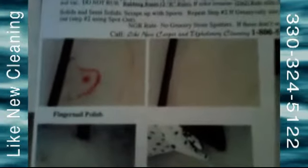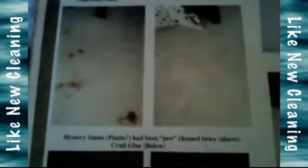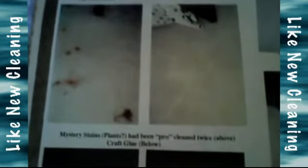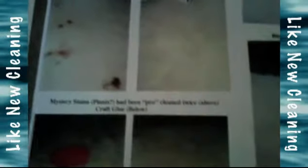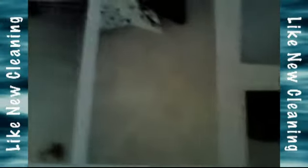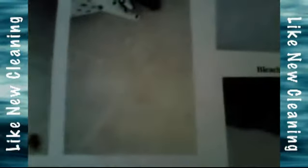We're going to do some videos on these as well. We also do an extensive amount of specialty spot removal. That's fingernail polish. This one over here is a bleach spot that I dyed. This is kind of a funky grayish, light grayish type of carpet. This one's an interesting one — those were mystery stains. That carpet had been cleaned several times before. Nobody knew what those were. You can see I didn't get them out perfectly — I bleached them just a tad, but that was far more acceptable. That house was listed for sale and they kept the carpet. I got to clean for the new owner as well.